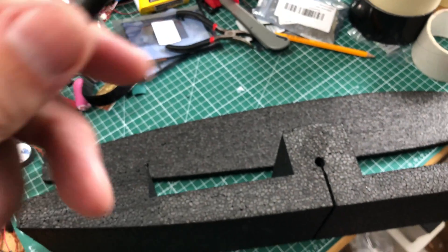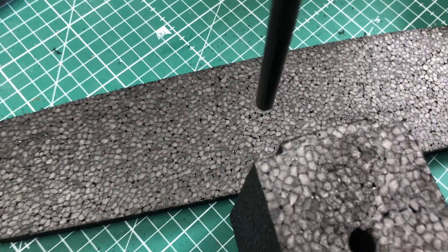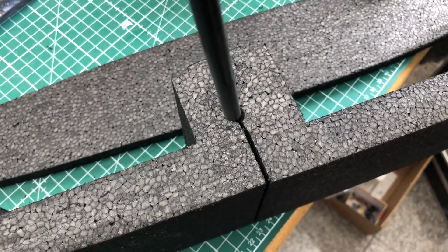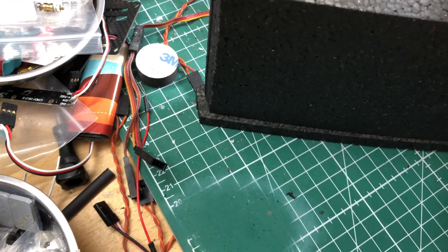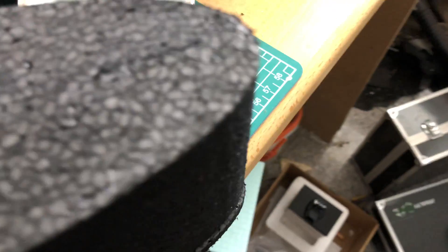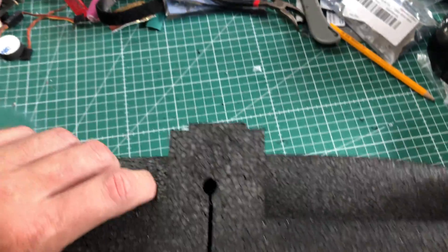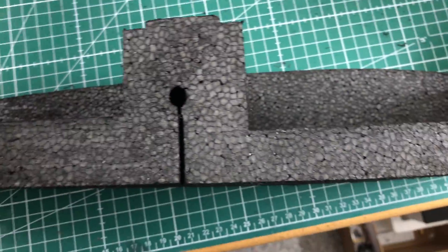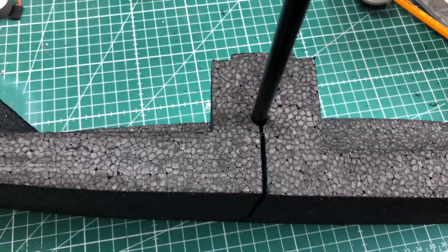Find the proper holes. The rod needs to go in there somewhere. To find the right hole, take this tool, align the edges. After having aligned the edges, take some tape and fix those positions — it doesn't have to move anymore at this point. Now turn the piece around so that the side plate will lie on the desk. Take the rod and push it through the hole. By doing so, we will mark where the rod will come out, and with that we can precisely make those rod partings through the sidewalls.